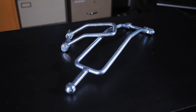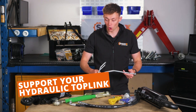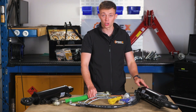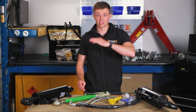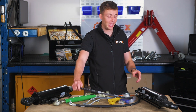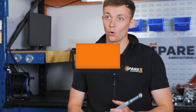A small but crucial detail for your hydraulic top link is a stand or clip. We've got a huge range of these for most makes and models and it's crucial to suspend your hydraulic top link using one of these, because otherwise it's susceptible to dropping and sagging which puts unnecessary damage, wear and tear on the hydraulic hoses and the cylinder itself. Make sure when you get your hydraulic top link you've got the correct stand or clip.